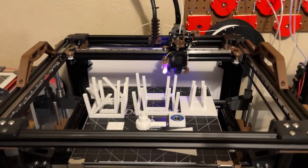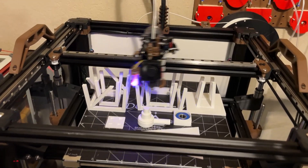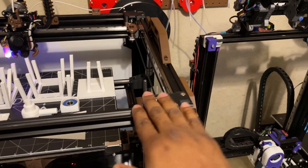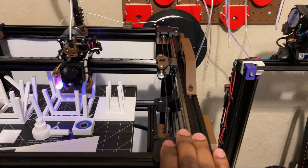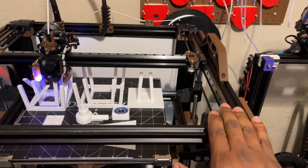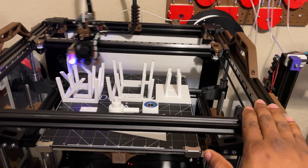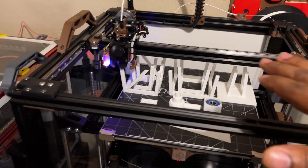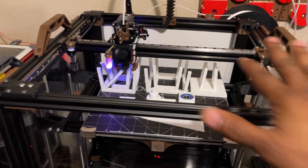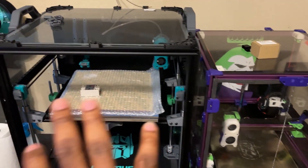So far I'm very impressed. It's a very easy build. I like that the STL requirements don't require 40% infill — it's more like 20 to 25% infill with four walls. That's where the strength comes from, but it helps lighten up the gantry, which is why you're able to print so fast. It's not as beefy as a Voron gantry.